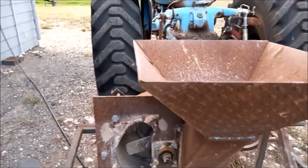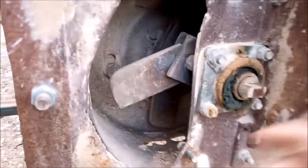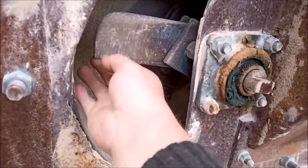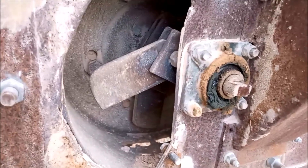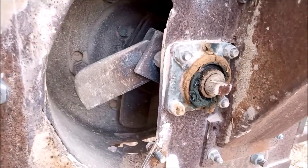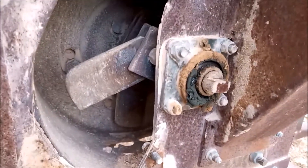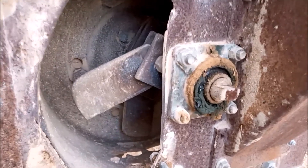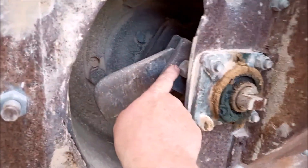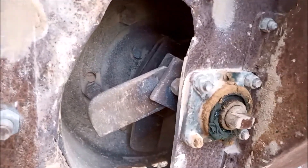So what we've got here are the internal bits. These components here are made of spring steel — they're actually a piece of leaf spring. I was using mild steel and I found that they wore out really quick. I'd crushed maybe five wheelbarrow loads and they were very worn out. I also found they were wearing through where the bolt goes through.